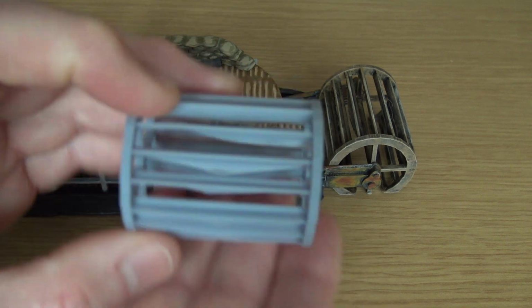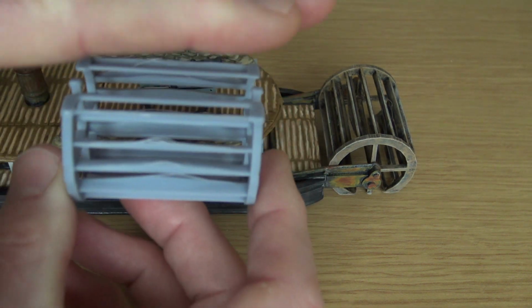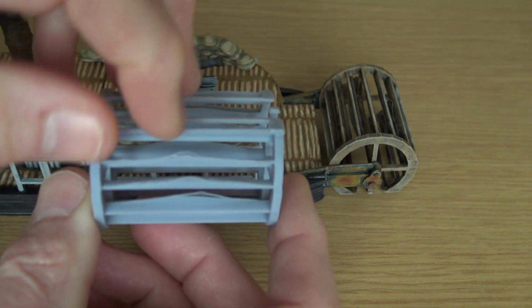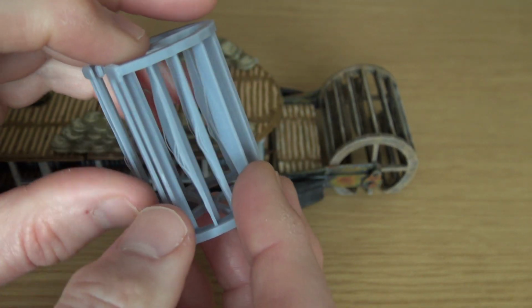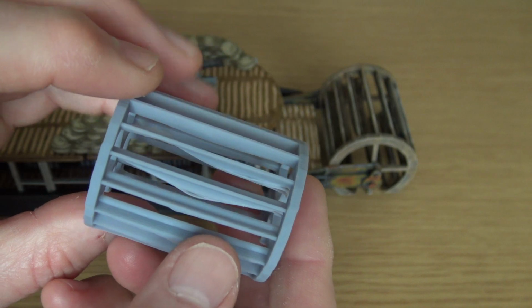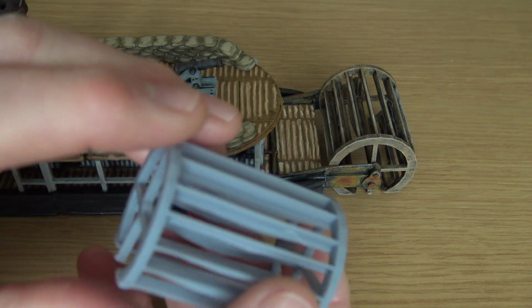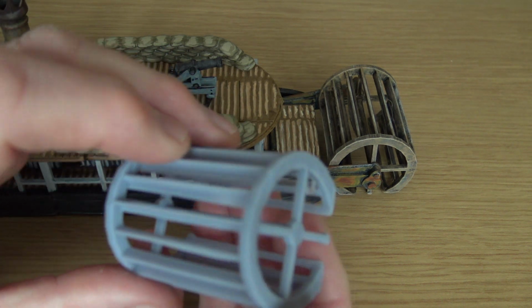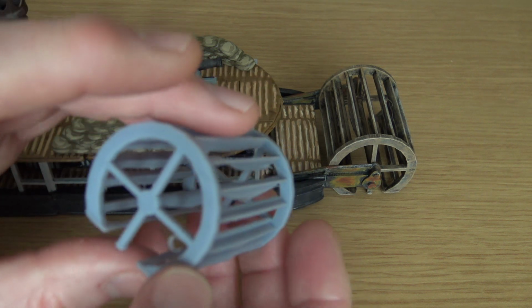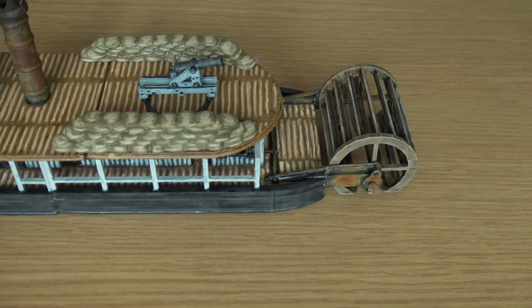But had I printed that on the build plate, where it's actually suspended in a resin printer, but had I raised it away from the build plate a little bit, and then put a raft there with some supports going down, I'm pretty sure that would have avoided that kind of error. So this is the other thing, that you have to try again, and that does use up the resin, so it's not very economical, really, in terms of cost effectiveness.